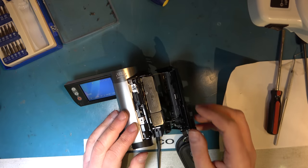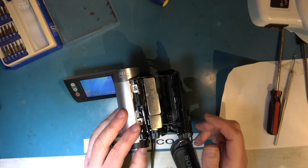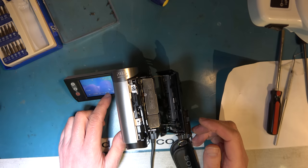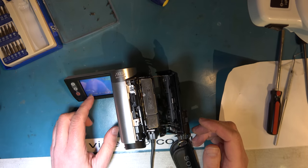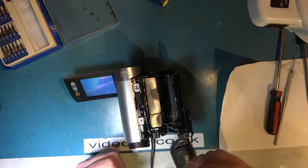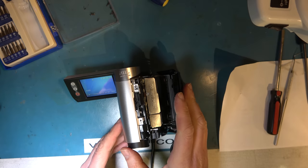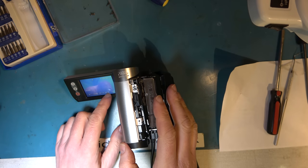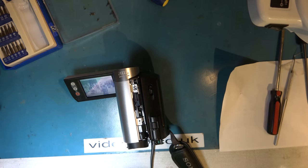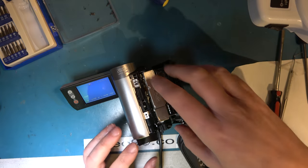And the situation is that it will eject, but getting it to accept the tape again is unreliable. I don't know if, when it fails to take a tape in, whether that's because it's mechanically jamming or because it's losing its position on the mode switch. But either way, it needs a new mode switch. But when it works, it does actually work. Not bad. I think I'll put the rest of the cabinet work back on, and refit some of the millions of screws that are missing.